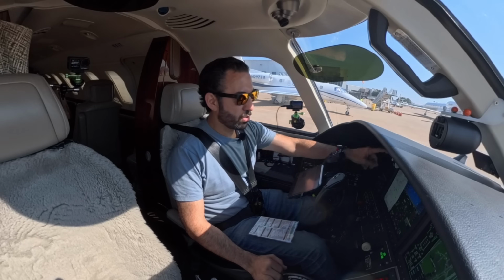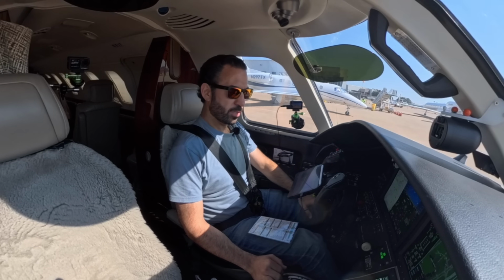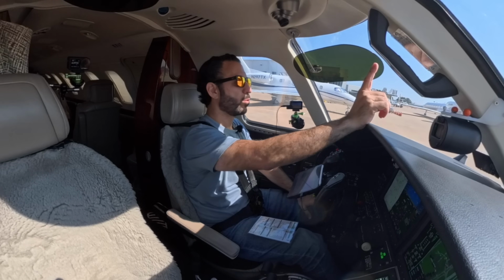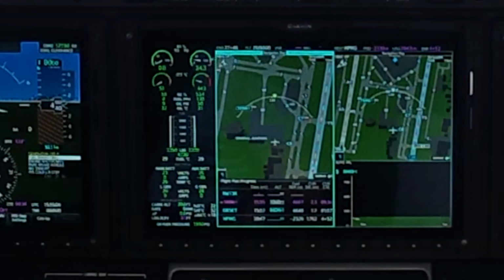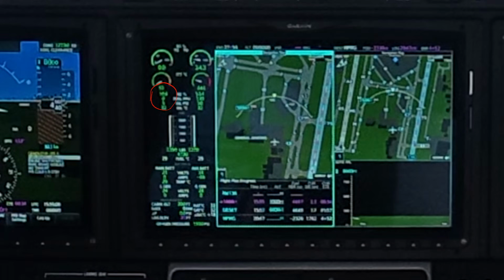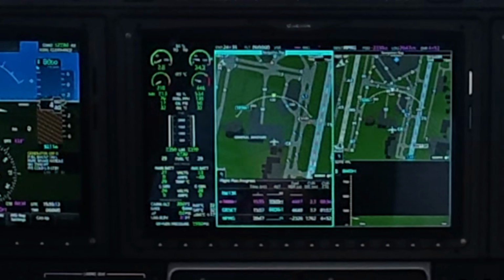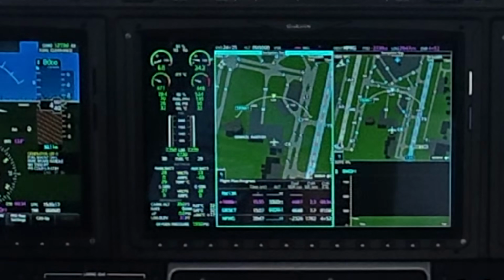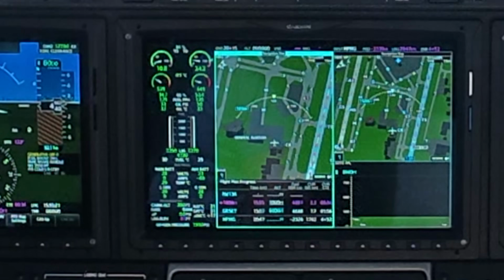And looks like we've got a good start over there. We'll wait just a second for everything to settle. And we'll go to engine number 1. 1000, 1000. Fuel boost, so we see it. N2, plus 10. Flight idle. Igniters. ITTs are coming up. N1 is coming up. And while this is going on, we still have the starter disengage up until N2 hits 42%, just in case we need to abort the start.